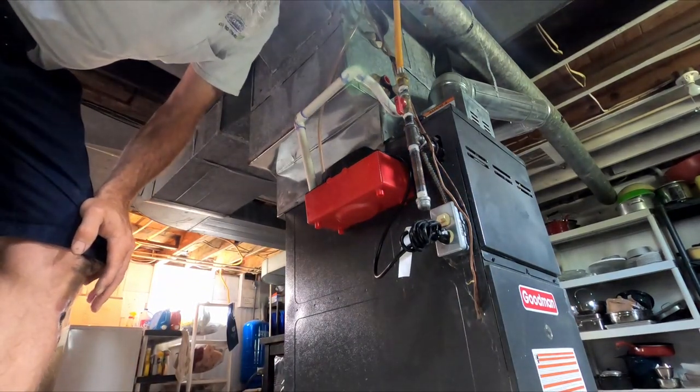Let me get everything wrapped up. Sometimes you get easy ones. That was pretty simple — there's not too much to it. Customer said it was coming out of the top, between the top part and the reservoir. That tells me the pump's pretty much done — I've seen it happen like that before. Not much to it, change the condensate pump out. Easy as can be. The condensate pipe was a little goofy but it works, it's in the pump and the pump's not sitting cocked. That's it for this one. Alright guys, like and subscribe and I'll see you on the next one.